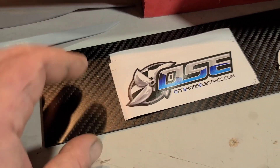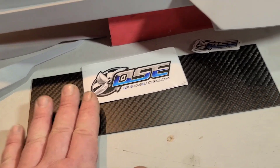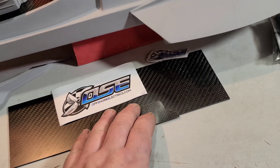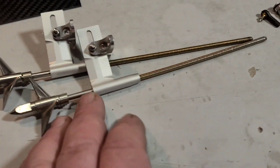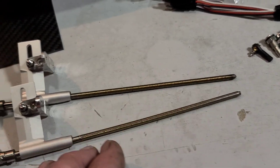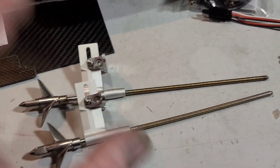From Offshore Electrics I got this two-millimeter thick, 11 by 4 or 11 by 5 carbon fiber - I'm going to use that for my battery tray. I use the same carbon fiber for my motor mount that I'm mocking up. I have a dual motor setup. With a twin motor boat you need basically two of everything: two four-millimeter flex cables, two drive dogs, two bullet nuts, two of the same propeller counter-rotating. Your flex cables need to be counter-rotating - a left hand and a right hand cable - with the corresponding prop on the corresponding cable, otherwise you'll spin your cable.